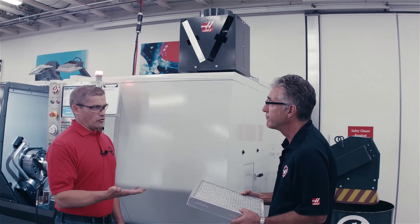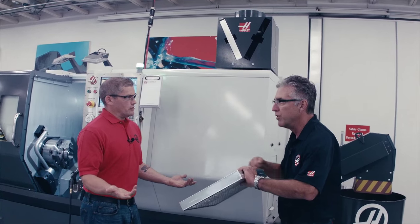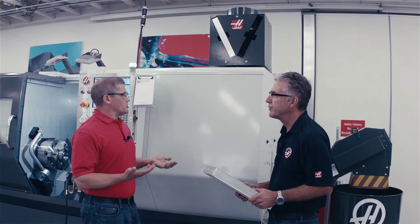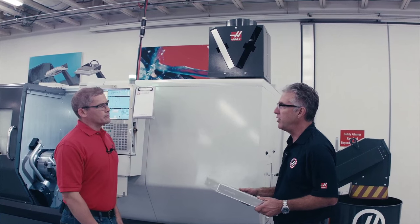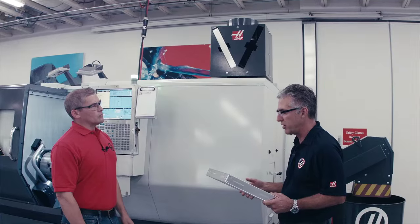So how do I do that? Are they hard to clean? No, not hard to clean at all. You simply would hose them off with a garden hose to get them back into service again. All I've got to do is just blast water through it and I'm good? Yep, run the hose through it and you're good to go. So how do I know that I need to do that? That's the beauty of the product being integrated with the Haas control. Unlike the other products on the market today, there is a sensor associated with the fan and the filters, and it lets the operator know on screen with an icon if the filters require cleaning.